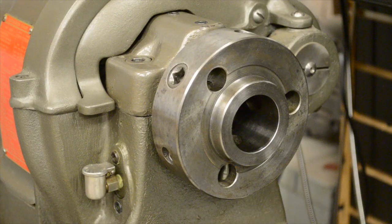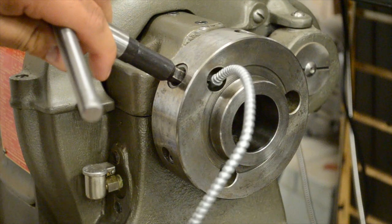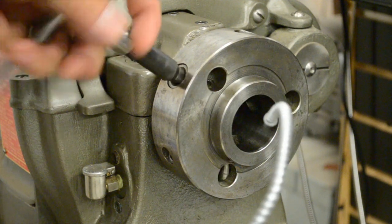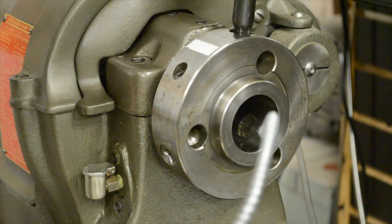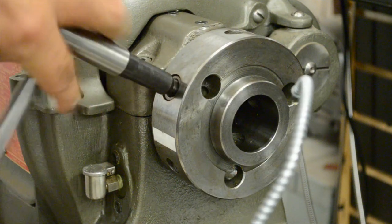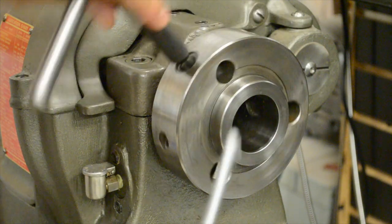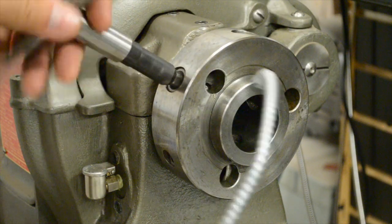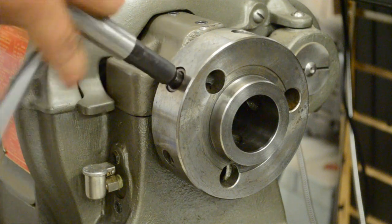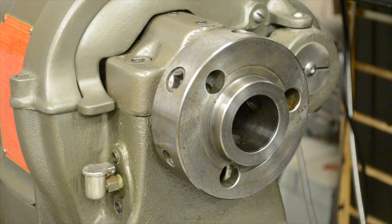The final place for the Type C oil will be your spindle mount. This lathe originally came with a threaded spindle, but I upgraded it and changed it to a D1-4 spindle, so I like to add oil where the actual chuck mounts to the spindle. If you have a threaded spindle, you can add the same Type C oil to the threads just so that your chuck doesn't stick the next time you use it.